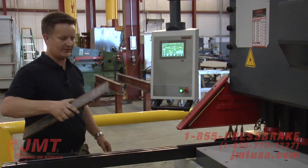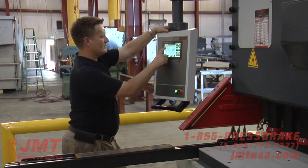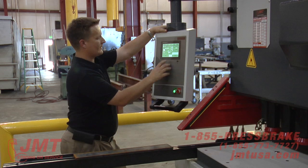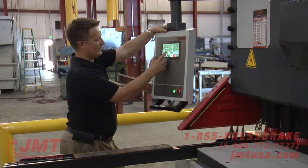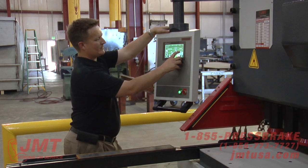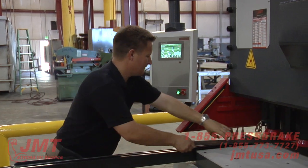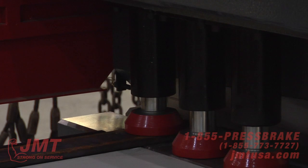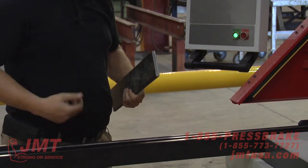Now I've got some half inch mild steel — this is just bar stock. I'm going to walk up and change to mild steel. I'm going to change my thickness to 0.5. Cut width, let's see, six inches. My back gauge — let's say I wanted it at three inches. Retract still at 0.2, but let's say I wanted it at 0.1. So my back gauge is going back to three inches. I'm going to cut half inch mild steel, six inch width. Hit my laser. Bar stock — pretty simple.